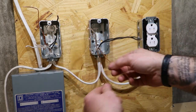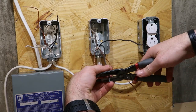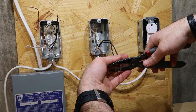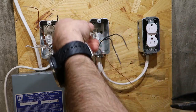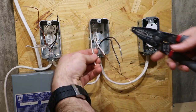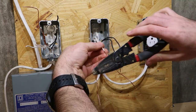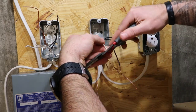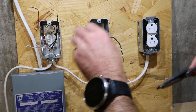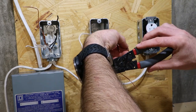Here's the second way to do it. It's got two wires — two sets of wires on this one. We do just like we did before. We take and we strip about an inch of coating off of our hot and our neutral. I'm gonna go ahead and make those hooks, just like we did before.